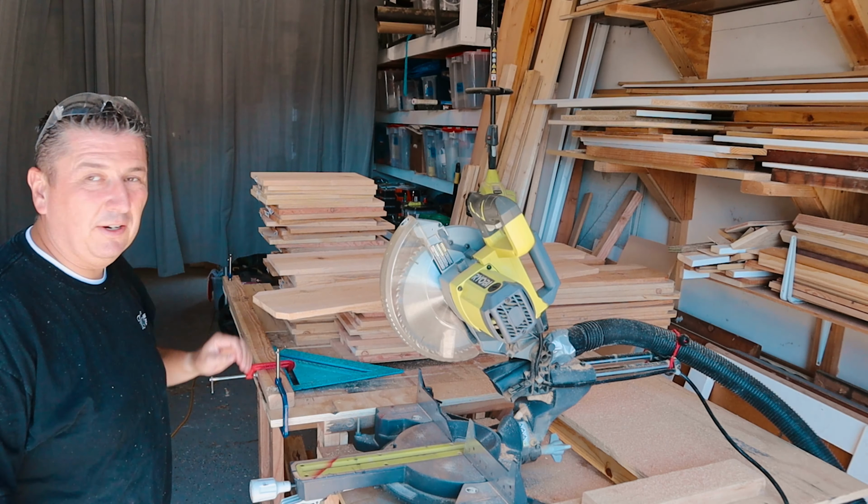Kind of hard to explain, but basically what I end up doing is I buy these redwood fence pickets that are 3.5 inches wide and 6 feet long, because this has an angle here where it's chopped at the top. I'm gonna cut these at 35 1/4. So basically, when I add the trim, we're gonna be at right about 3 feet in height.